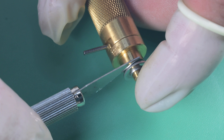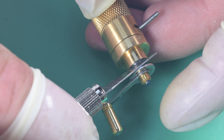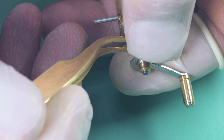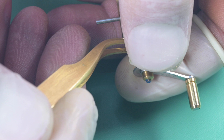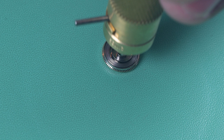After it gets wound, the challenge on these mainspring winders is to remove the winding arbor without the spring coming out with it. I start with a kind of an exacto knife, and then once I have room I use my tweezers to pull it the rest of the way out, then set the spring into the barrel.